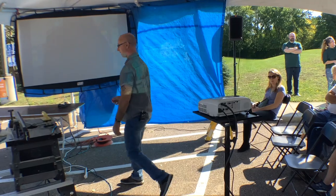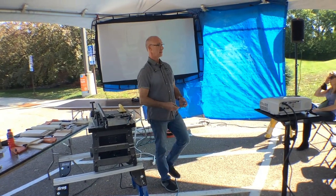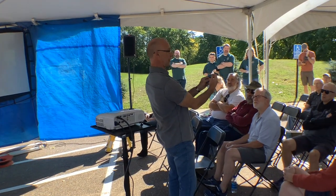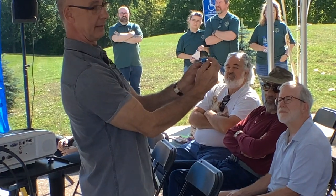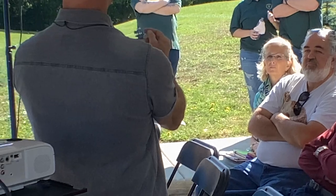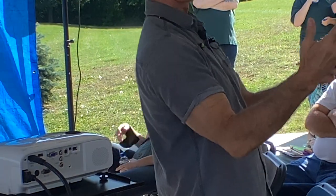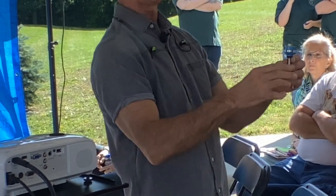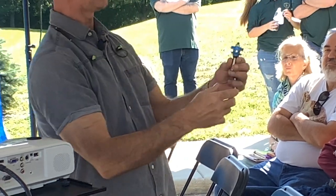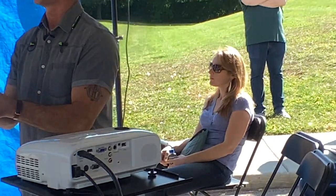And a lot of times it's as simple as starting with cleaning the cutter. For a cutter to cut, there has to be clearance behind it. If you work with a lot of resinous woods, cherry and pine for instance, you can get buildup behind the cutter that prevents it from having that clearance. That'll cause it to burn and it'll slow down your feed rate as you cut. So a lot of times just cleaning it is enough to rejuvenate it. I would do that first and then check for dullness.